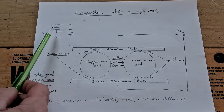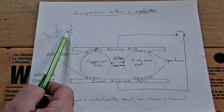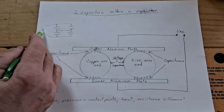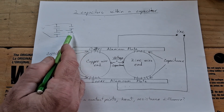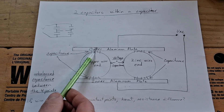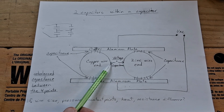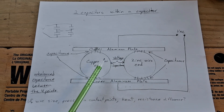The schematic looks like two capacitors in series here, two in series here, and we're noticing a charge in between them. With capacitors in series, it divides the voltage you see between them. Now, if the capacitance of each of those capacitors were exactly equal, you wouldn't notice any voltage in between. What was brought into question was whether the sizes of these wires were exactly the same, because if one was bigger than the other, the capacitance at those four points wouldn't be equal.